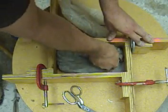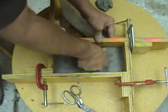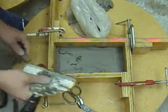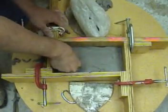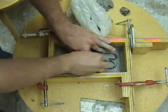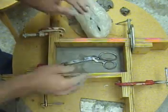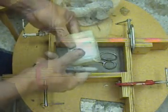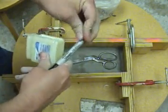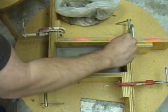This is wet clay, or water-based clay, sold under the name white modeling clay. It's a very basic, easy-to-use, water-based clay — very soft, so it's great for building mold dividing walls and that sort of thing. Once we've smoothed out that clay, we want to gently press our scissors into the clay. Then we need to define some keys, so we're going to lube up one end of a Sharpie marker and use that to create some negative keys in the first half of our mold.